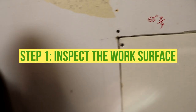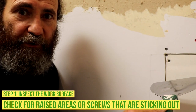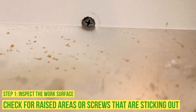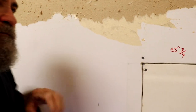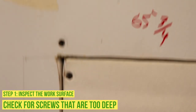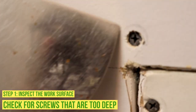When we put the screw in, we're not gonna put it too deep because it will cut the paper and the board would not hold. I'm just gonna show you one screw that went too deep — you can see the paper is cut. Here we have some good screws — see, I can try to remove it and the paper is not cut, so it's not gonna come off.